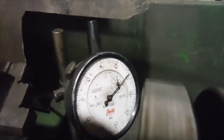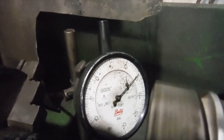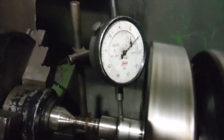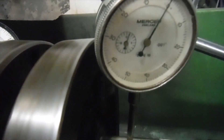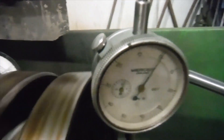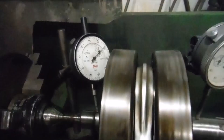I'll just hold the camera with my left hand — it's a bit less shaky than my right. On the timing side shaft we've got half a thousandth of an inch rise and fall, and on the drive side we've got no more than one and a half thousandths of an inch — almost sniffing two thousandths but not quite. That's very good indeed.